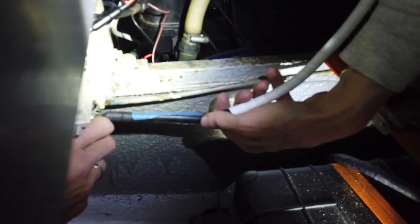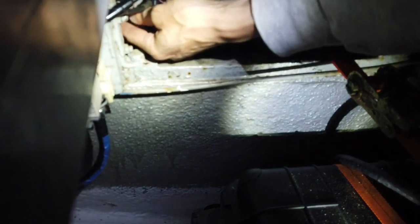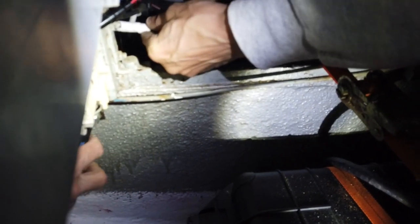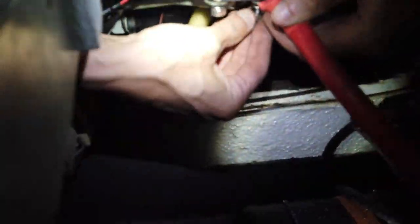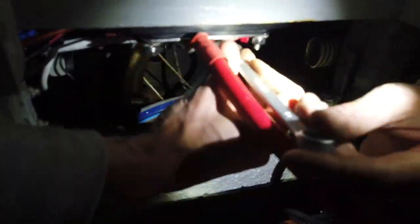The biggest loads of course get another dedicated fuse — in our case the inverter, which will be powering our galley when underway, and of course the anchor windlass, which has its own designated breaker in the electrical panel. After just connecting all the plus poles to yet another bus bar, we were already all set again with the lithium battery set up. We have only had it in use for 2 weeks so far, but it performed flawlessly. In a few months we will report again and let you know how the Hometronics performs in the long run.